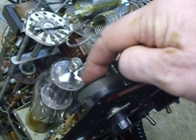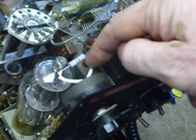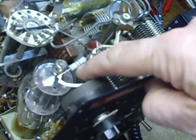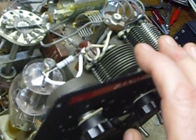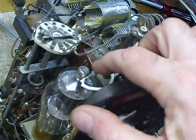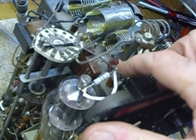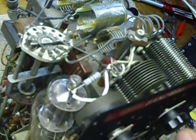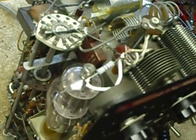I've got exactly two inches of stiff braided Teflon-coated wire in there. I had a 47 ohm 2 watt resistor in my resistor box, and I was just about to give up and set it on the shelf. Then I thought I'm going to take that 47 ohm resistor and put it across that wire from here to here in the form of a suppressor. I did that — soldered it here and soldered it here — and my golly, that cured the problem. I thought this is really something.